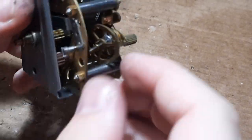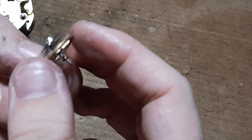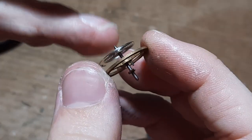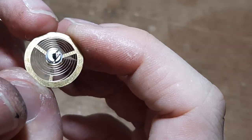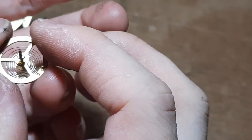Once you've got the tail of that tiny spring out through both of those holes so it's no longer in that brass regulator or in that gluey hole, then it is safe to undo this cup on here, face the movement down close to the ground, and let that balance wheel fall out. There we go - fell out. This is looking alright actually, the points are still quite sharp, which means that it will probably run quite well once we're done with it. That is the balance wheel with the hair spring.